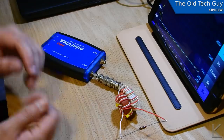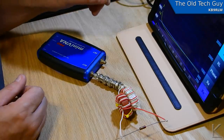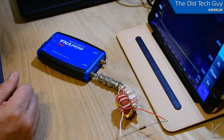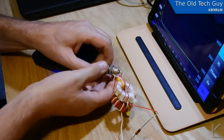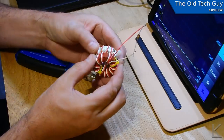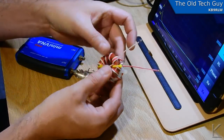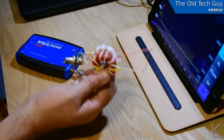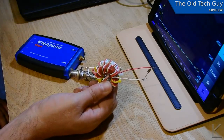That's a four-to-one balun. I'll be able to mount this into an enclosure or onto the center insulator and we'll have a good match from 200 ohms down to 50 ohms. I'll link M0PZT's site if you want to read more about the construction of this one, but as you can see it's really straightforward — basically two common mode choke wirings wired up as shown in the photograph, and that is your four-to-one balun. I'm going to get back to work on the antenna project — watch for that video coming up next. It's a really exciting and interesting antenna and I'm looking forward to testing it out.